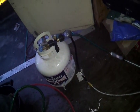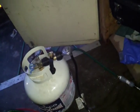It's supposed to operate at a head of only one meter. Right now we're taking the cold water supply and running it through a little 12-volt pump that is attached to the car, and then that is going into the heater. The heater is a natural gas heater. I've got it hooked up to a propane tank and a little regulator, so it might not be optimal. There's a switch here that turns on the electric element and then it lights.